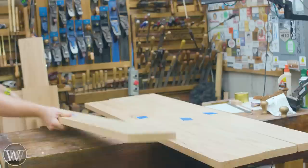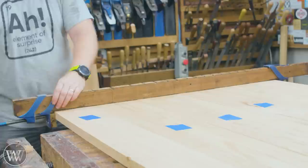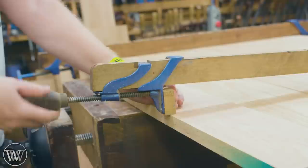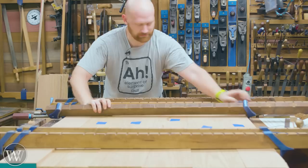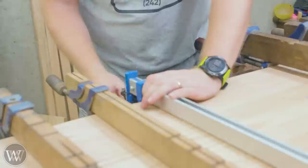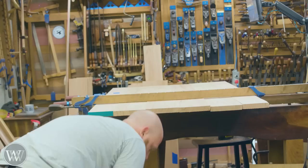Before any glue-up, we want to make sure we do a dry fit. Get all the clamps set up because you don't want to be rushing when you're actually doing the glue-up. Do the whole glue-up without the glue, then take it apart and do it again. Now all the clamps are set up correctly. These are wooden beam clamps - I have several videos on them. They're all antiques; you can't find anyone who makes these anymore because they'd be incredibly expensive. But I don't even have enough of those to go across this wide board, so we're going to need to pull in some Harbor Freight clamps.